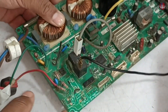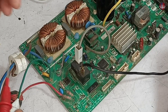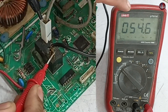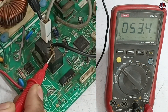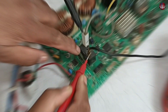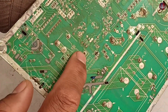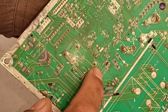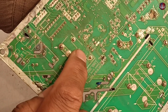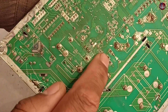If I check the relay without passing electricity to the circuit board, it should not show continuity between the two terminals. The continuity value is 53 ohms — this reading is of the PTC sensor, because both pins of the PTC sensor are joined with relay pins. It can be checked with two more methods. One is to check 12 volts on the coils of the relay — if proper 12 volts are passing, the relay is bad; if 12 volts are not passing, the relay is okay and some other component in the circuit is bad.